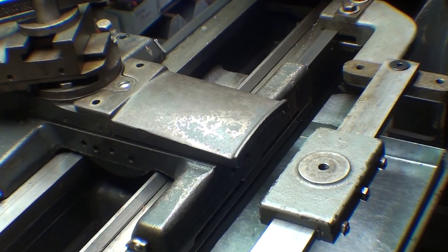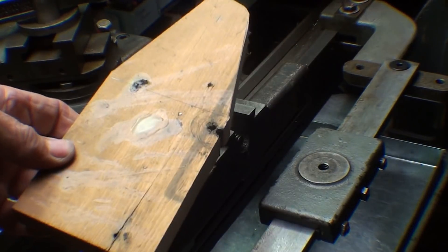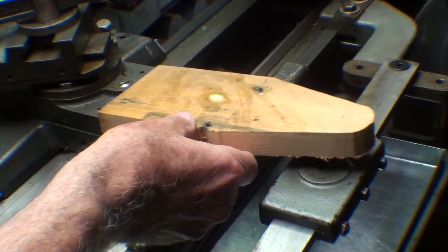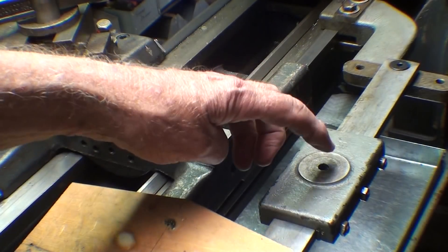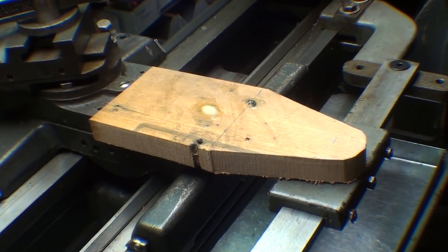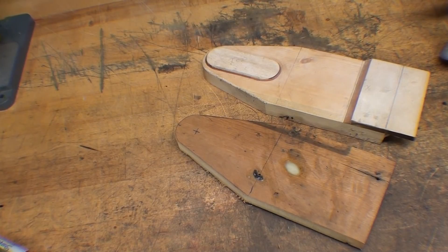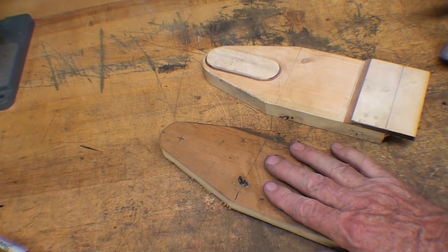I have a taper attachment for the South Bend lathe, so I don't even really need this, but I just need it for the video. I made up this wooden model just so I can visualize what it will be. On the bottom of this there will be a dovetail that will fit right onto there, and then a piece that will come up over and bolt right into these two holes, and then a slot here that will connect and be bolted onto this piece. The hard part, of course, is going to be the dovetail. I never did make a drawing. From the model I modified it just a little bit and made the pattern, which took maybe an hour.